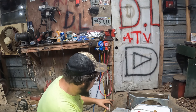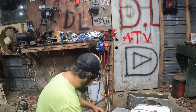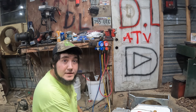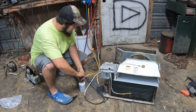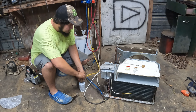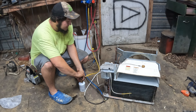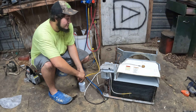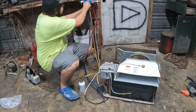The unit is plugged in because when we get some pressure in it I'm gonna turn it on so it will pull the low side down. I'm just hoping my hose right here will stay together. I'm opening my can down here and it should go through. These new cans have a safety top. The vacuum is still drawn on the unit — you want to keep the vacuum on there so you don't trap any air in the system. There's still some residual air in there since I didn't run nitrogen through it, but not as much.